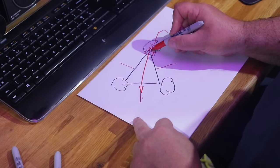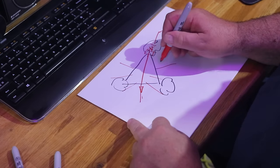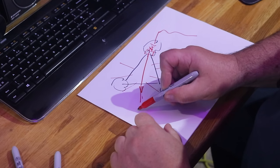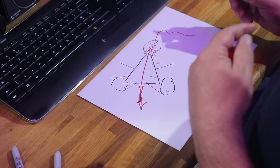You end up with this sort of clock-face pattern — gain going this way and that way, mostly forward, some on the way back. The higher up in frequency you go, you start getting more little gain lobes, almost like a clock face. We had this down at the scout hut. Ours was about 158 meters of wire at 60 feet — about 20 meters above the ground. On 10 meters it was massive gain, something like 10 to 15 dB, and it just so happened that the USA was off that direction.